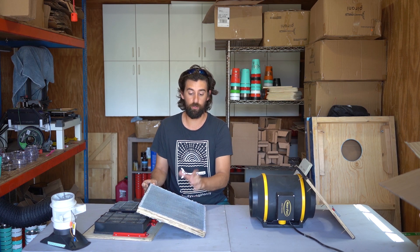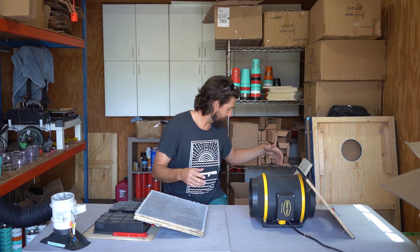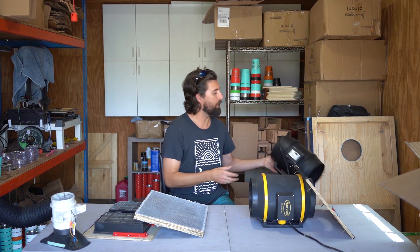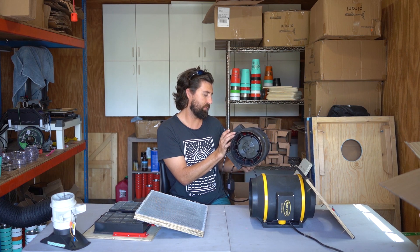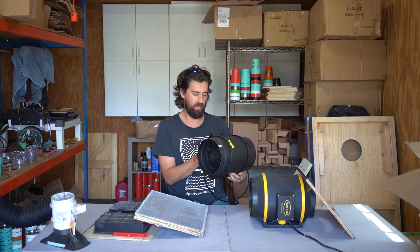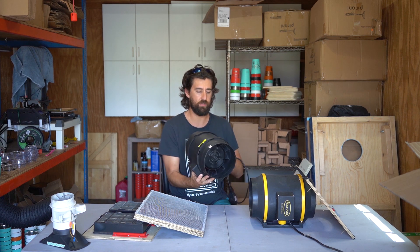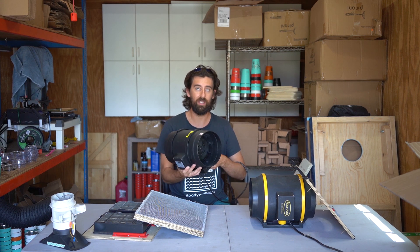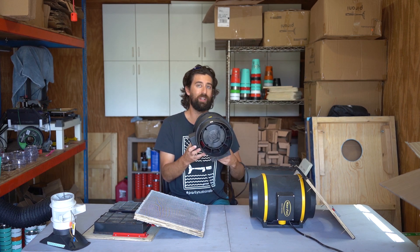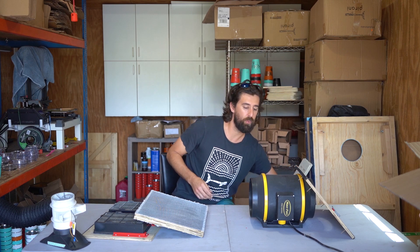This thing wasn't pulling air through the 4 inch, and it barely pulled air through here. So this was the original blower that I bought, and this thing's rated for — I think it's like 600 CFM. It's 190 watts, 1.6 amps. If I turn it on, this thing is a beast of a blower, but it is very much a ventilation blower. It's a low pressure blower.